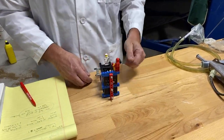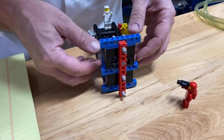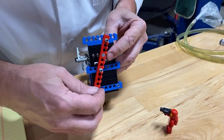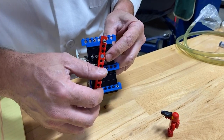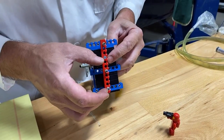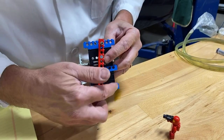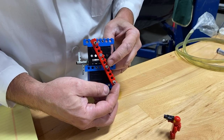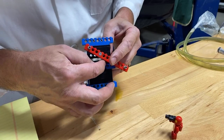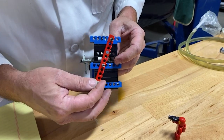This also applies to levers. This is a lever attached at a pivot, and if we look at the ends, one part goes further than the other part. You have the same thing with force, and it actually happens to be the same ratios as those gears. This end is seven units and this is three units. Swing it over and this end goes seven units for every three the other goes — you end up with that same multiplier.